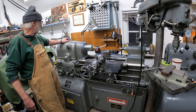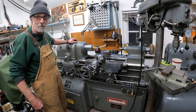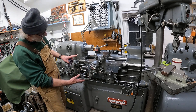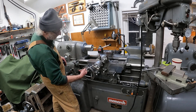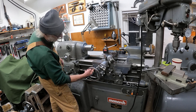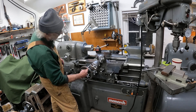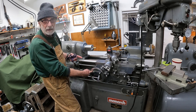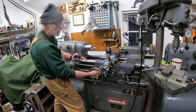I've got it running right now at about 1500 RPM. I've got it in high feed and it's pumped the carriage up — the carriage just moves real nice, really oiled. When the oil is low the carriage sticks, and you really don't want to move it like that. You want to pump it up.